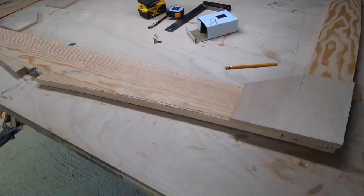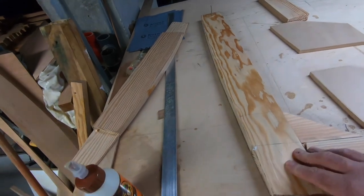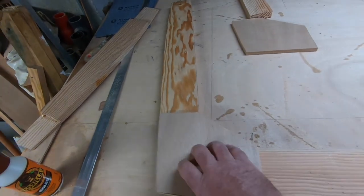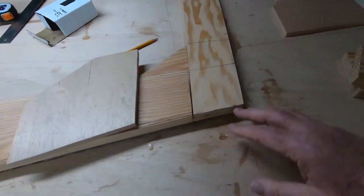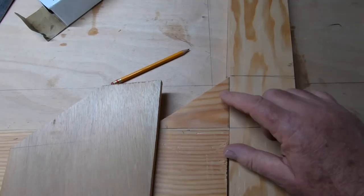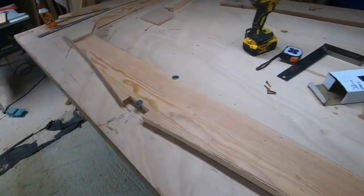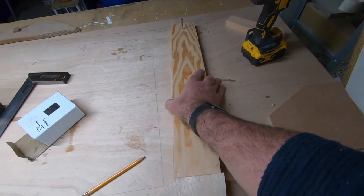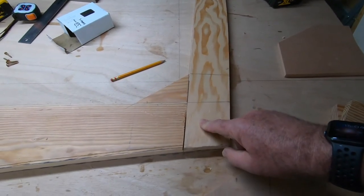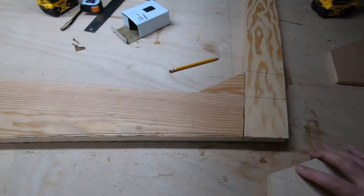Morning — a continuation of frame three. I've cut out the base piece of wood, I've got the two uprights today. I've managed to actually make them all fit, which is really good news. I've marked out my plywood corner panels here to strengthen it up. I've also made the lapping joint here and filled in the corners with triangular pieces to strengthen it up. I'm just about to glue this up and hold these in place with a couple of screws to stop them moving past the line. Once glued, I'll screw these in and put a couple of tack nails into the joint to hold it tight. I've put screws with washers to hold the base frame in — which has always been a problem before.